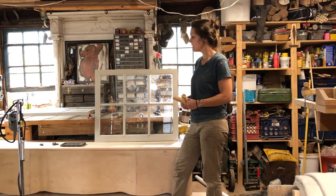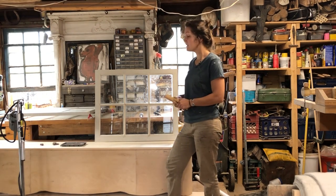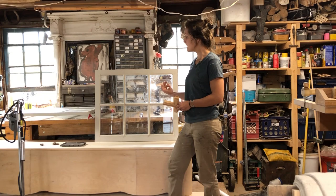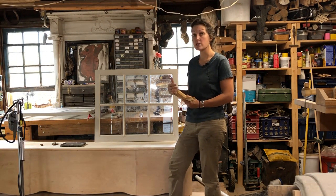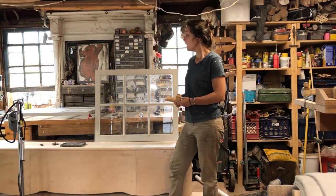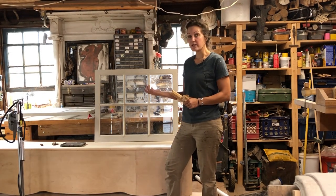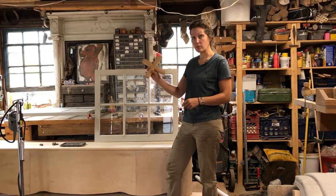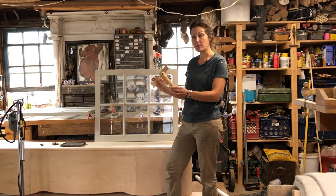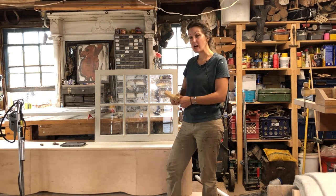I'm not going to label this a DIY video, but since these are going into a basement the customer did not want to spend a lot of money making proper windows. So I designed a way to make these that utilizes more bridle joints and lap joints, which was much easier than making them the proper way. I have a video on my channel that shows how to make windows more realistically — it's a much more intricate way using mortise and tenon, lap joints, and cutting angles, making it a very time-consuming project.